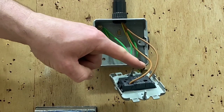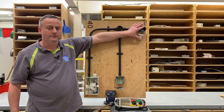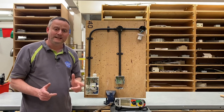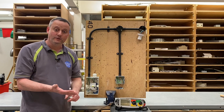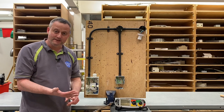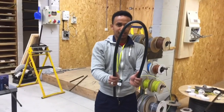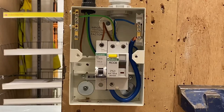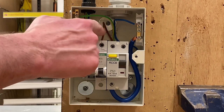We'll also prove the CPC gets up to the plastic light fitting in case it's changed in the future to a metallic one. In this video we're going to carry out the continuity of CPC, include the polarity test at the same time, and then follow it with the insulation resistance test of our level one plastic conduit lighting circuit.